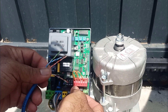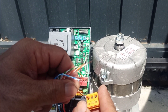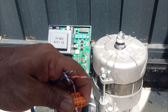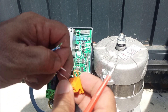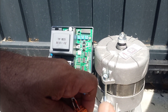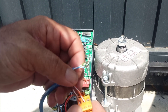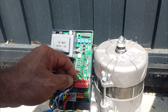I am moving now and there is terminal 50 and 51. I am connecting 50 brown — that will be in photocell on number two — and orange is 51, that is number one in the photocell. Now this is ready, and I remove this connector from here.